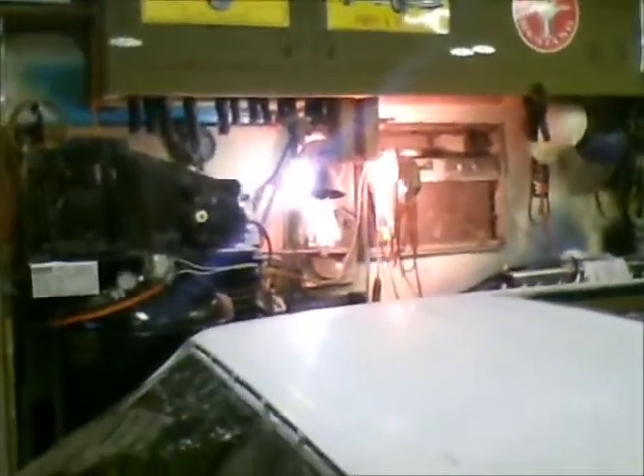I'll turn that around a little bit so you guys don't have to look at all that bright light. You'll see whenever the air compressor shuts off that both of the lights will go off. In effect, if those were fans, it would turn the fans off and on as the compressor cycles. If this were a really high amperage appliance being powered off of 110, I wouldn't even try to do this because it could overload the ground going back to your electrical panel. But for something as simple as a couple of small box fans — they're going to be pulling less than half an amp — I don't see anything wrong with this. If you did effectively have a short, it would trip the circuit breaker in the box. It's not a preferred practice, but sometimes you have to do what you have to do to make things work.